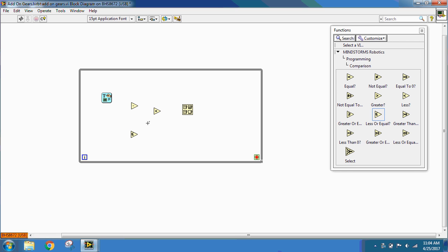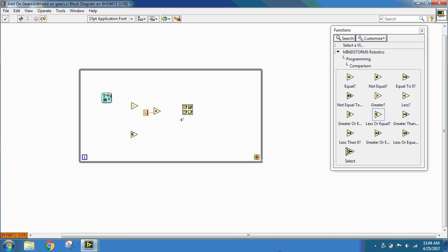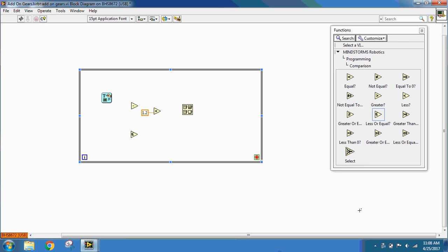The Multiply block needs a constant for its Y value — I'm going to create a constant at its Y value and put that at 1.2. Next, I want to take the ultrasonic value, the sonar distance, and feed it into the Subtract function block. I'm going to create a constant of Y for an 8. The result of that — X minus Y — is going to go into the Multiply, and that result, multiplied by 1.2, is going to go into the X part of my Max and Min block.